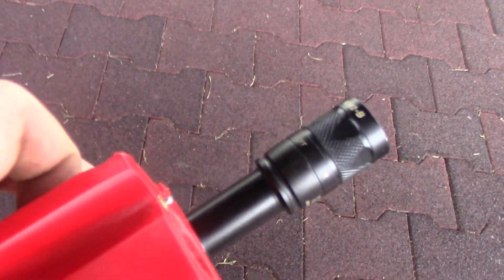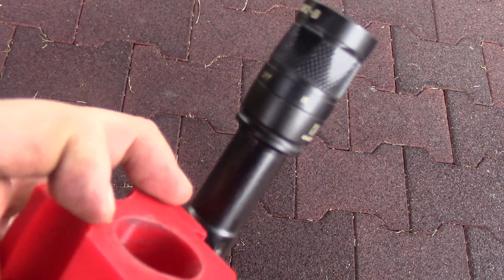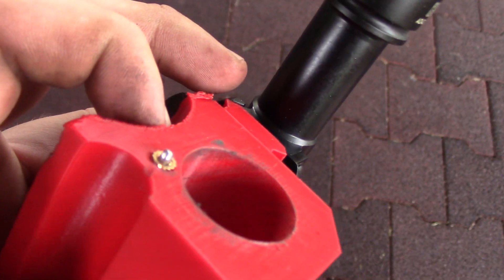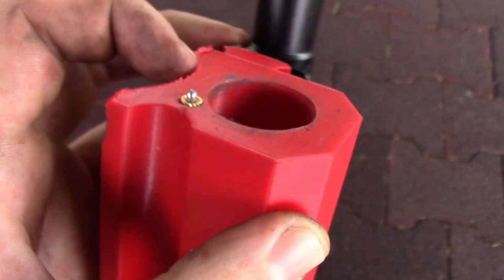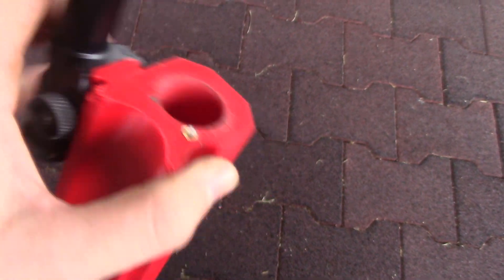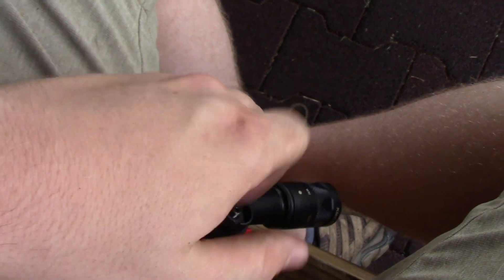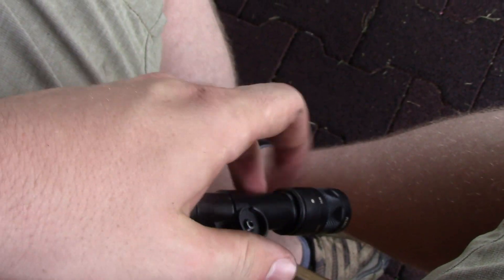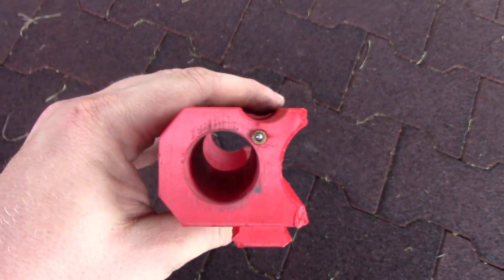My detent is still retained and it's not letting it fly out. That's just a little polished roofing nail that I rounded down with some sandpaper and some files — and that works just fine. My little Picatinny rail that is also printed into this held on. And this isn't 100% infill — this is seven walls with 30% infill in cubic subdivision.